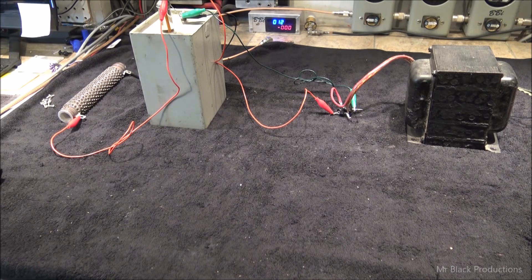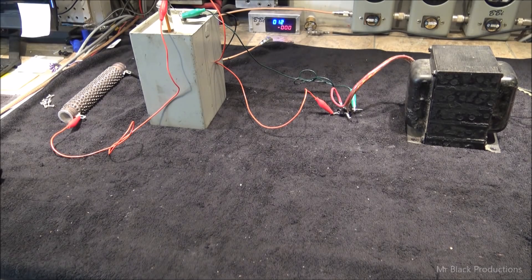So when this gets all the way down to zero, that's when the bleeder bar starts to cool off. Otherwise it's always producing heat. Now I'm going to go through this — hopefully I'm not going to bore the toenails right off your feet — but you have to understand the whole circuit. And this is a pretty dumbed-down version. Most of the parts aren't to scale. Like your high voltage bridge — there's more tricks to this than just taking four diodes and putting them together.